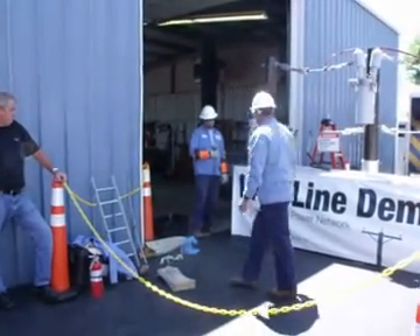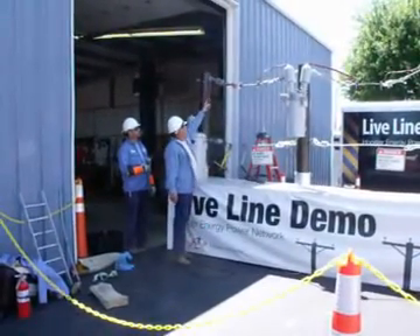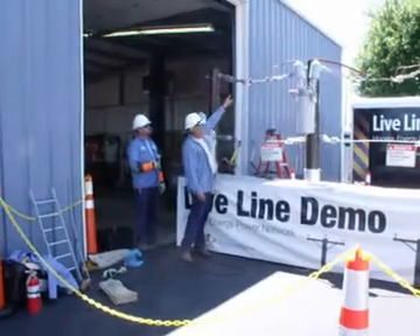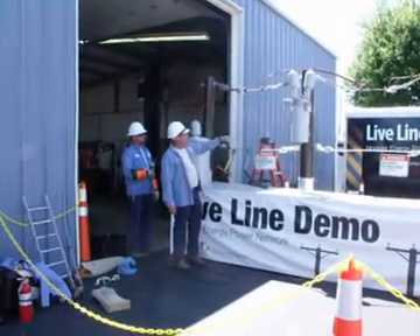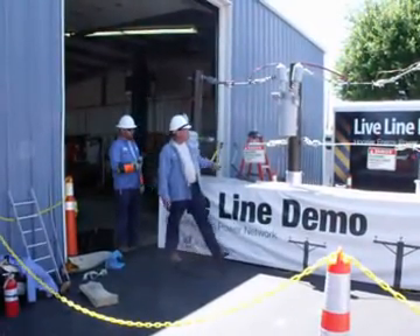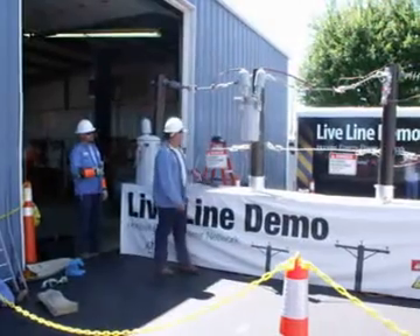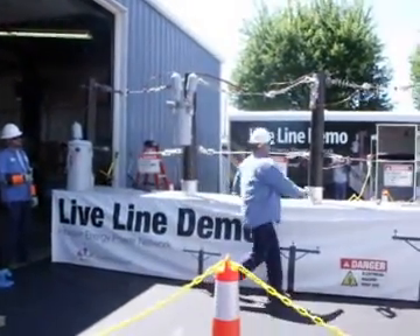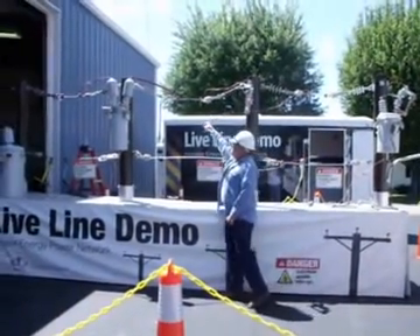These right here are insulators. Everybody sees those — we've got porcelain insulators. Those are epoxies, these are shoes. These are the ACSRs. That's neutral, that's the primary. Then we've got hotline clamps — that's the standoff. Then we've got the bugs. Everything's bugged — we bug everything. Back here, there's aluminum bugs on the back side, just where we make some connections.